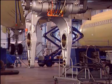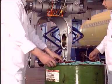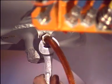Let's now remove the shock strut and capsule. Install an empty barrel under the shock absorber. Remove the blanking cap of the filling inflation valve. Fit a flexible hose. Open the filling inflation valve and drain the shock absorber.